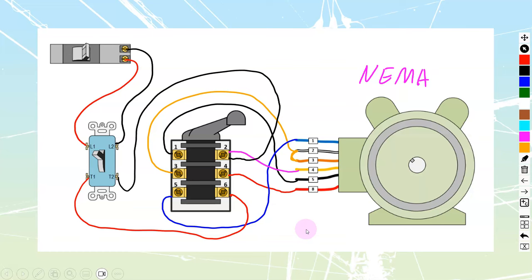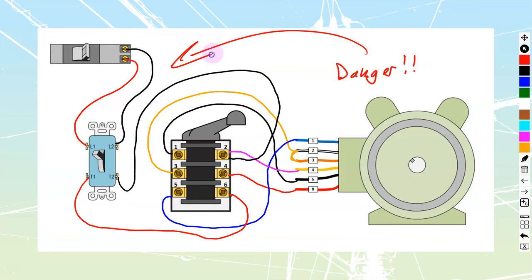Do make sure that you put some sort of danger sign on this motor directing people that they need to use the disconnect switch to isolate it. Otherwise you could have somebody relying on the drum switch while there's still live electrical inside.